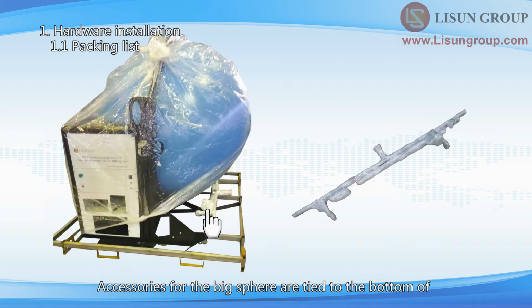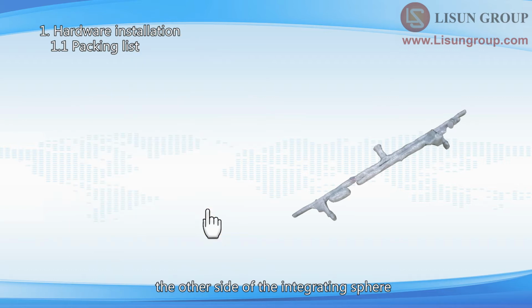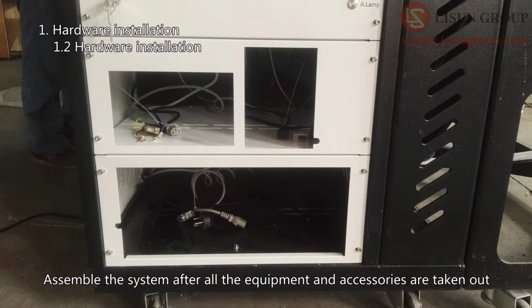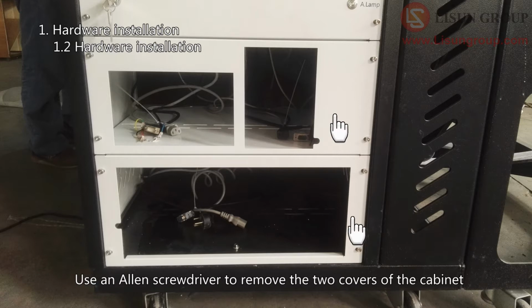Accessories for the big sphere are tied to the bottom of the other side of the integrating sphere, such as the holder base, E27/E40 holder and T5/T8 lamp tube fixture. Assemble the system after all the equipment and accessories are taken out. Use an Allen screwdriver to remove the 2 covers of the cabinet.